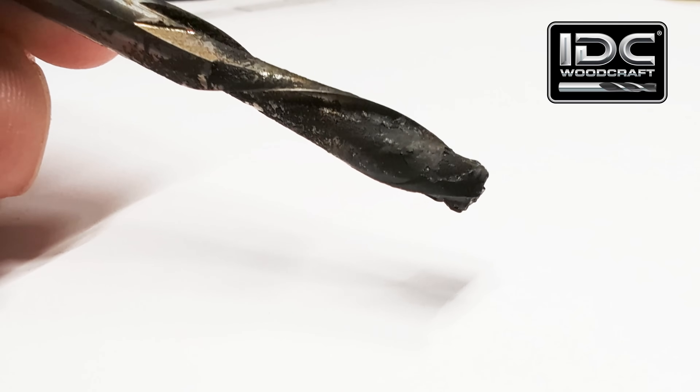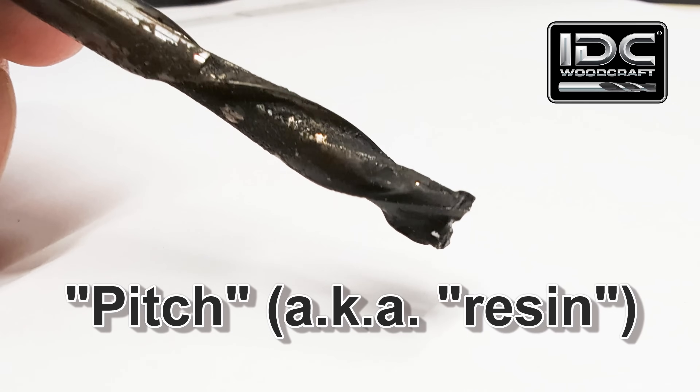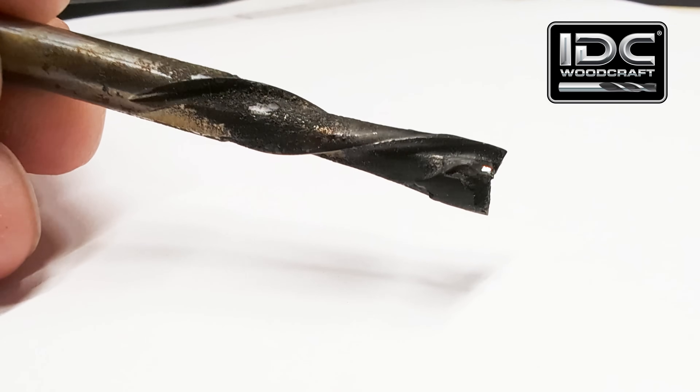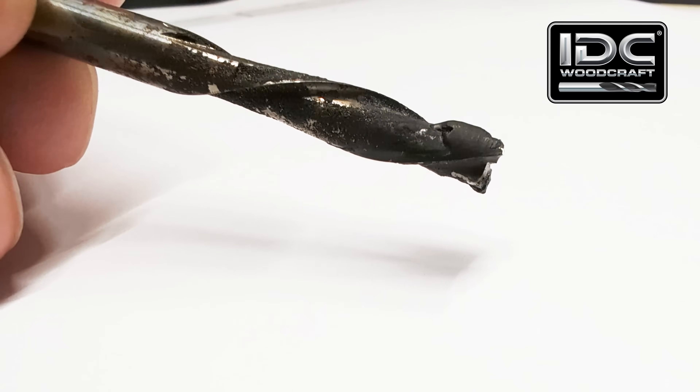Here's the bonus tip about CNC router bits you will want to know about. All wood has sap in it, and some wood has a lot more sap than others — like pine, which is loaded with sap and we cut a lot of pine on our CNC routers. When a cutting tool is cutting through wood it generates heat, and we always want to dump that heat into the chip. However, we are also melting the sap as we make that cut, and then that sap will stick to your tool and harden back up, creating a really hard coating called pitch. This CNC router bit is an excellent example of that pitch buildup — this is an extreme example; CNC bits should never get to this state, but it demonstrates what pitch buildup looks like.